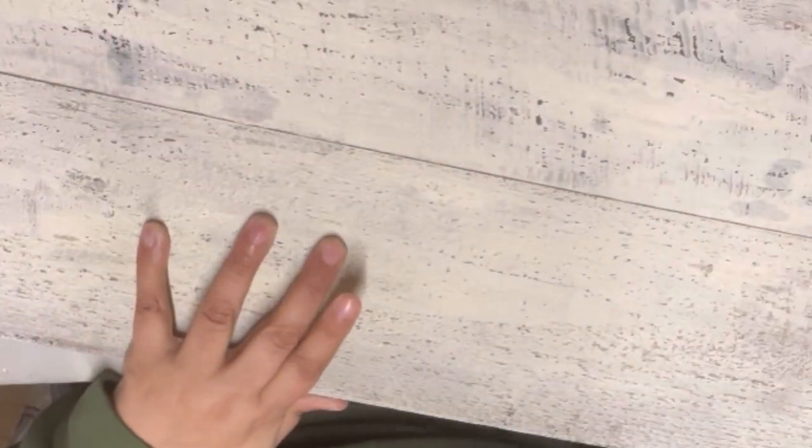You see how we got here. And I didn't make a lot, so I didn't continue layering. I find that you get the best effect when you layer your milk paint. Heat it, layer it, heat it, and layer it over and over again and build that texture and build that paint up.